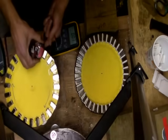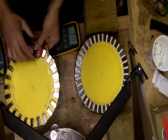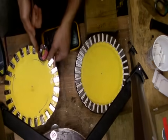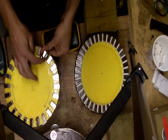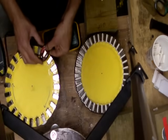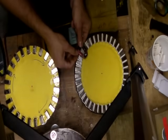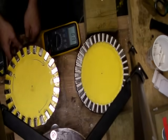This shape here, when it's over one magnet, the legs are not touching the other side. But when it's over both magnets, it's flush — one leg is over the other. This one is lacking some winding, but if I add winding I'll end up like this and then I don't have room. It's not as flush on top of both magnets, so it's losing some efficiency. On this one it's a little too big, and this one is way too big.